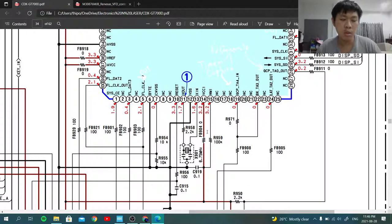But if talking about bit banging, I need to get around the speed of using the C language by needing to write some kind of inline assembly, like I used to do, and I certainly will do with STM8. And it would be faster, I believe. I'm not sure, it depends on many factors. But I never do assembly on STM32 before, so it might take a longer time.